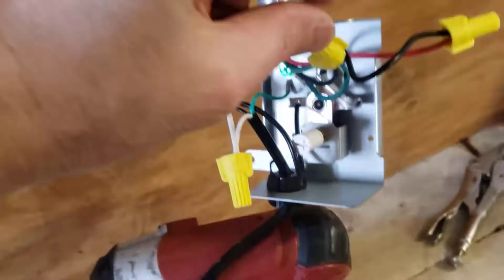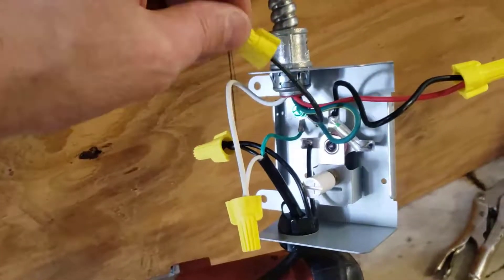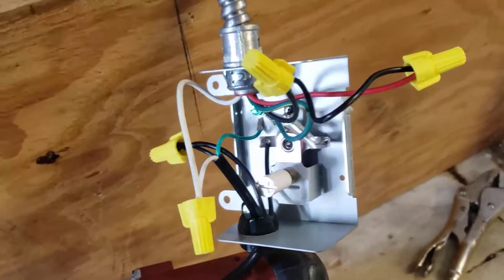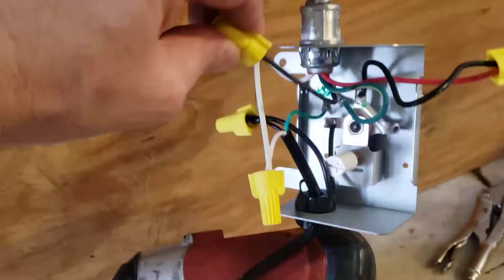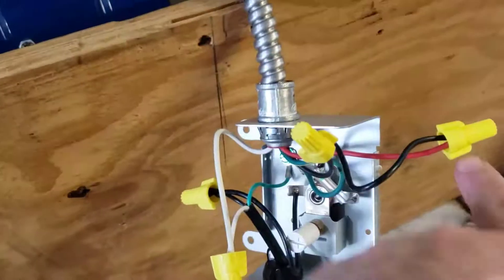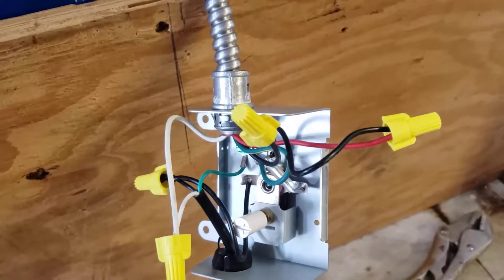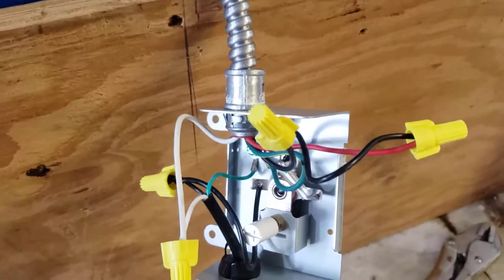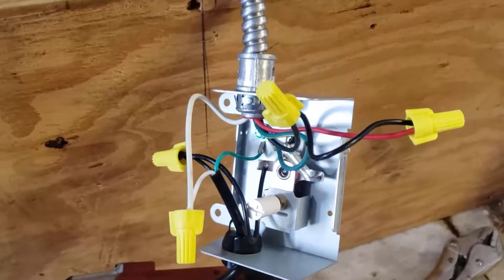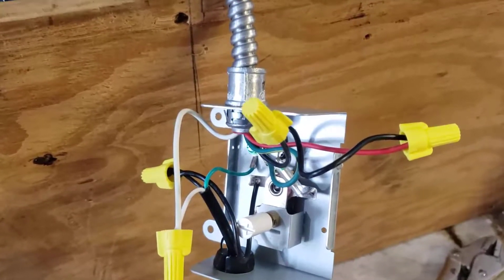What I had to do — and I want to bring this up — is I had to rewire this. The way it was originally, this black wire here was connected to this black wire here. Don't touch this stuff, it isn't live right now. The black wire coming out of the MCT is the high-speed fan and the red is the low-speed fan. So I moved it from 1900 CFM down to 1400 CFM to keep it more in line with my exhaust fans, because my ultimate goal is to have equal pressure between the intake and the exhaust.